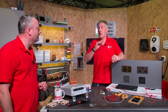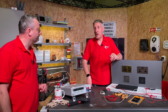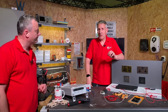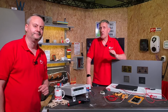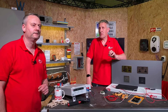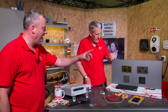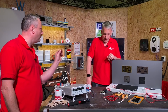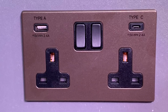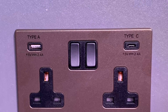Joe covered one described as Lot 20 in a video to do with electric heating. External power supplies come under Lot 7. What that specifically says when it comes to a power supply is: when it's not being used, or when it's in an unloaded condition, it mustn't consume more than 0.3 watts of power. So we've got four USB chargers — one in each of the actual outlets — so that's 1.2 watts as a maximum load. Even though there's two sockets here, that's classed as one charger.